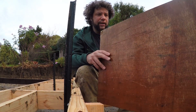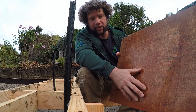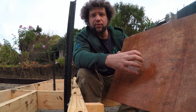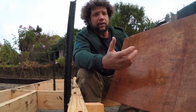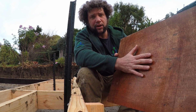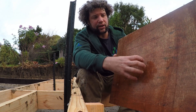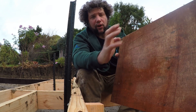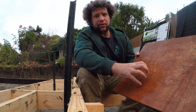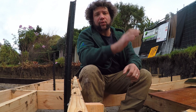Here is normal ply. Normal ply doesn't have a non-stick coating on it, and the actual face of the ply can stick to the concrete. When concrete is wet, it will absorb into the dry timber or ply and soak into it. You can actually rip the whole front face off the ply as you're trying to unbox the slab. So never use face ply or normal timber ply — only ever use form ply.